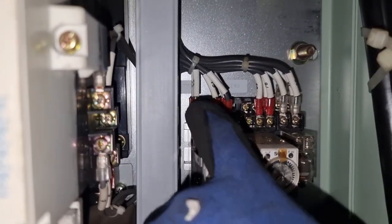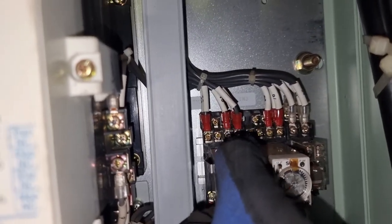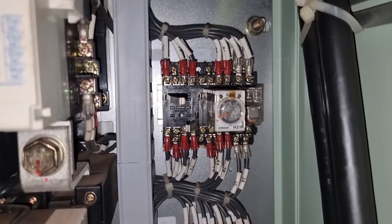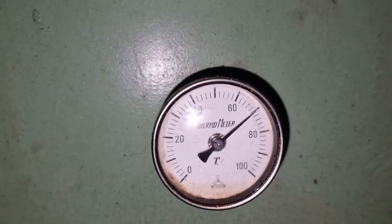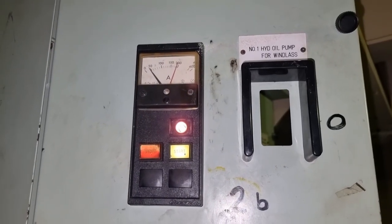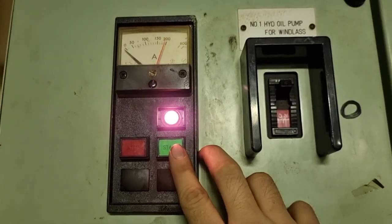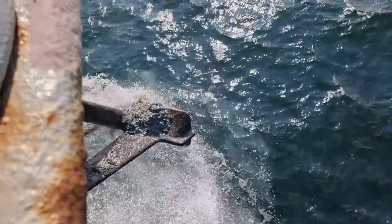Since the anchor is just two to three meters from home position, we need to remove the TM2 timer so that the system will still operate. This will only require a minute or two to secure the anchor. I removed the TM2 timer, which cleared the high oil temperature alarm and allowed the system to run. After that we tested the system, which can be started once we remove this TM2 timer.